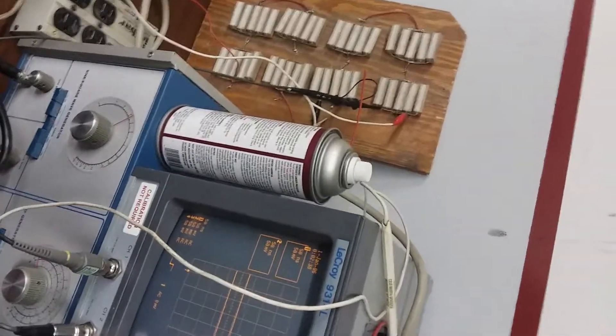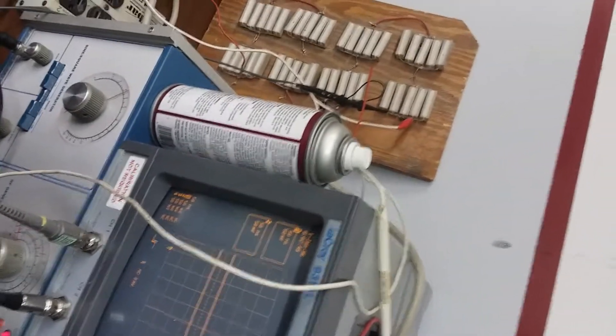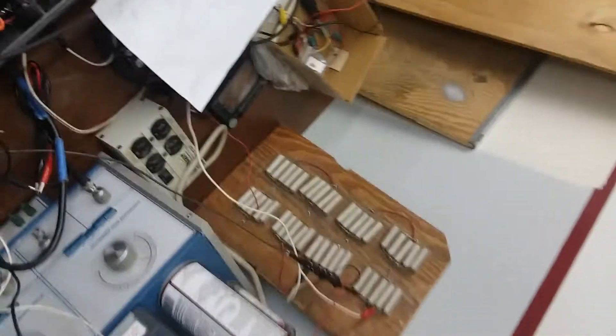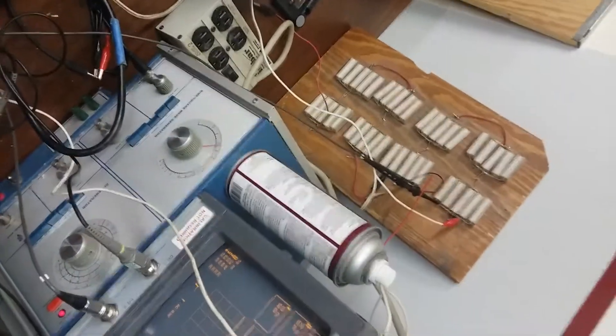The sine wave — in short, believe me, it goes up to almost 60 volts and it's breaking up at the 12AU7. That's the bottom line. It has the headroom on the rails to get up to the 66 volts required to make a 275 watt RMS output as it says it should have. I assume that's RMS — they haven't started using cheesy consumer audio wattage, have they? With those eight big outputs, it's got to be 275 watts at 8 ohms, right?